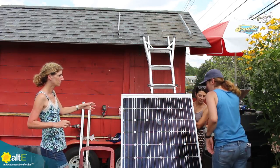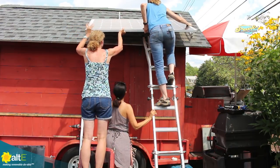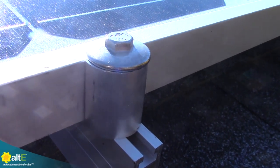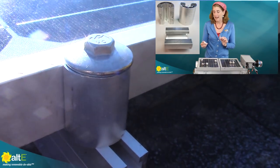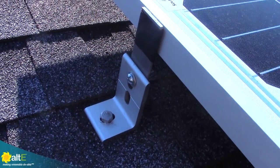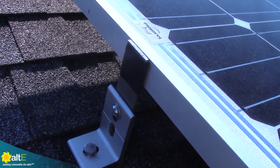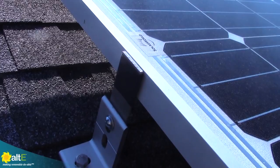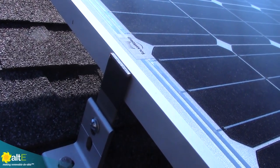The lovely owners of Snappy Dogs, Teresa and Lisa, are going to help me put the solar panel up. We've got a nice tight connection with the Iron Ridge UFO clamp and the 33-millimeter sleeve that clips on to match the panel thickness. Because this is a mobile trailer, I wanted to do a little bit extra, so I added an extra L-foot with a small extension as a stop forward and aft of the panel — just in case of a car accident with tremendous force forward or aft, this will act as a stop.